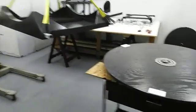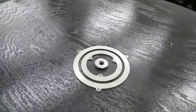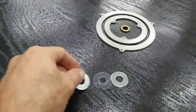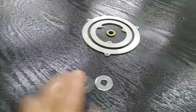I have my rocker hanging here and I'm getting ready to put it on the ground board. But before I do, I wanted to talk about how we shim between the ground board and the rocker. Here you can see I have a series of two stainless steel shims and a plastic shim.